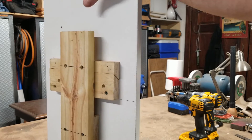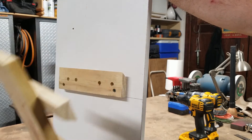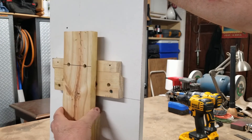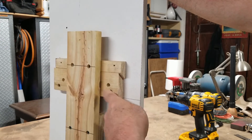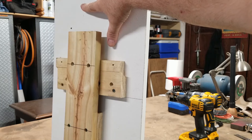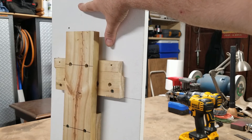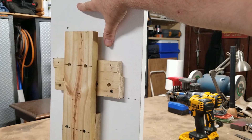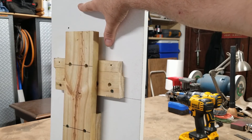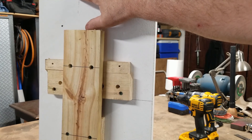When you're ready to take it down, carefully if it's a big piece — just lift it up, take it down, unscrew it, move it, change it. Plus you have that left and right motion depending on how big the piece is. Fantastic joint. Cheap, simple, few screws, bit of wood. The only hard part is the table saw or some kind of saw — you could do it on a band saw or even carefully with a seven and a half inch skill saw. Great joint. Enjoy. Subscribe. See you later. Bye.